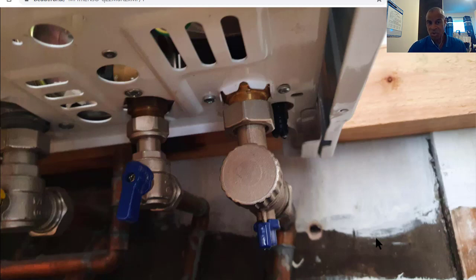The boiler location is important because this determines if you need to isolate the boiler. In this case we don't need to because it's upstairs. You can see at the back you've got a drain plug — what I did is just put a container underneath, open that, and then allow the water to drain out. Once you do that you can see inside the boiler.